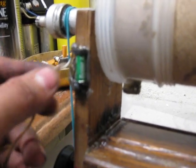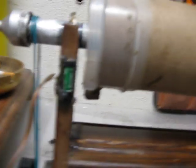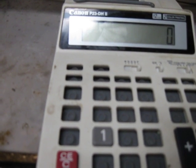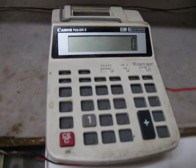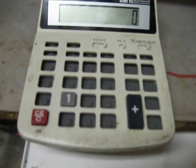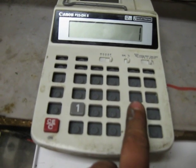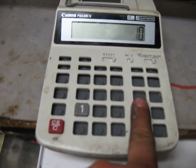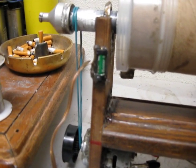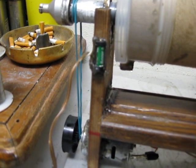Right here I've got a little 8-volt reed switch I pulled out of a phone system I had a long time ago. I've got that wired up to an old adding machine. You'll note the lack of all the keys — I tend to forget sometimes that calculator keys aren't always in one nice neat connected tab; they all just kind of rained pieces. I've got it wired up just to the plus switch. Since it's an adding machine, equals usually does nothing, so you do one plus one and every time you hit plus, it adds. Since that's a reed switch, any time the coil wrapped around it is energized and making a magnetic field, it closes the switch, which is where I have that hooked up to.